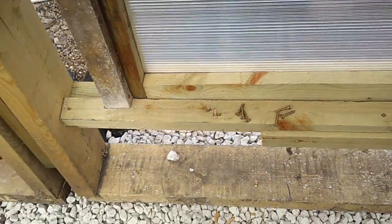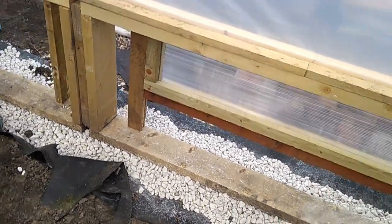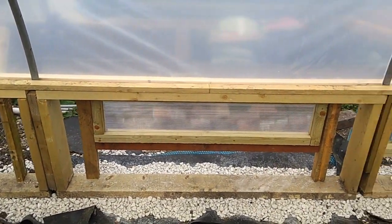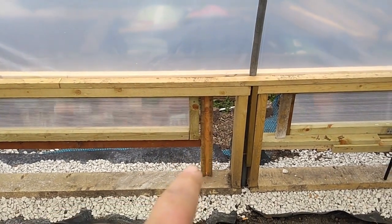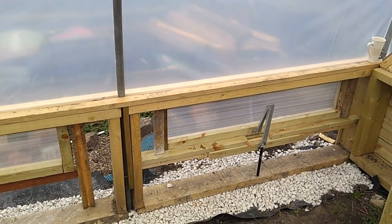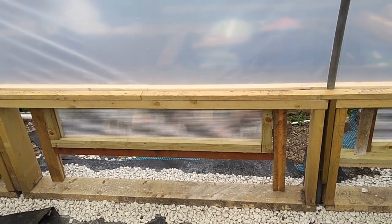And I've not done it the same on these ones as I have on the first one. I prefer that really. I've got the full drop uprights in there, and then the bar going across the bottom, and then I'll build out from that with the closers, to put the closers on from this side. It does take a little bit of wood to get it right, as you can see, but it'll stand the test of time.